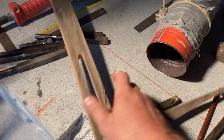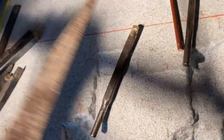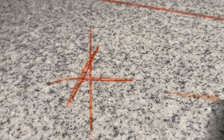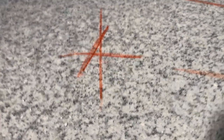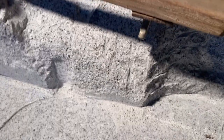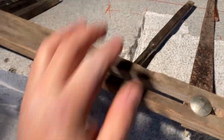As I'm shooting points, this is just a good habit to get into. When I first set this up and we're close, I take my compass, put it in the hole, and I'll mark my swipes approximately with a pencil. You've got to check everything as you go. This is a big exercise in double checking and triple checking. You should swipe them initially, and if you swing this and these dimensions overlap, something's wrong — you've got to be able to look at that real fast and figure it out.